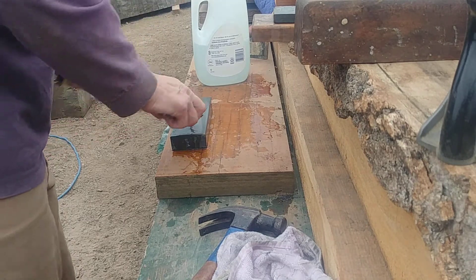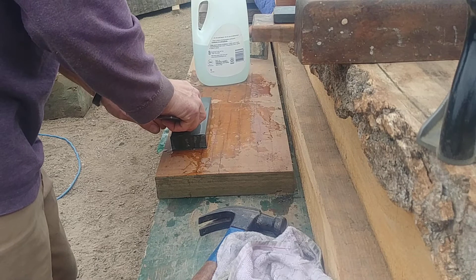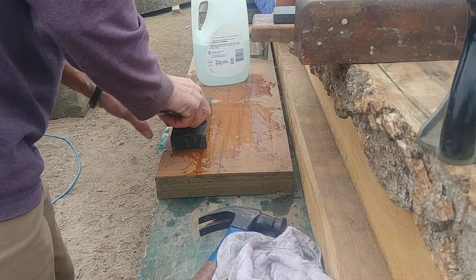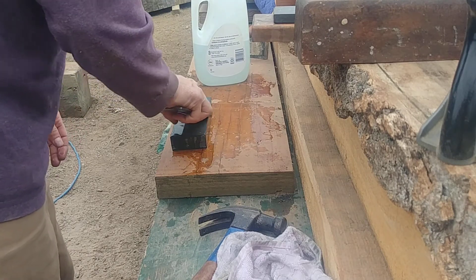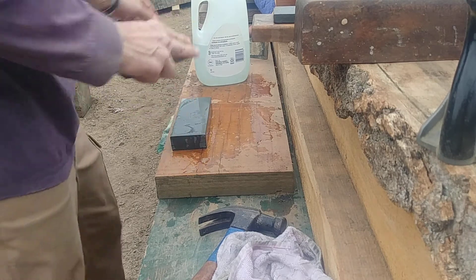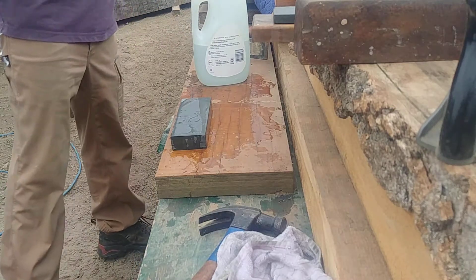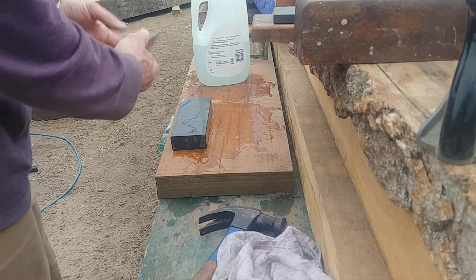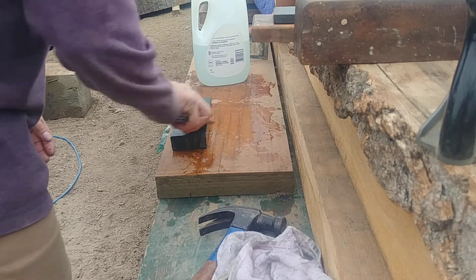The burr's back around in front. This stone, by the way, is a natural stone out of Japan — not really sure of the grit, advertised as 13,000. In the beginning it wouldn't cut much, but as I've used and conditioned it, it cuts wonderfully. It's the only other stone I need. I have a million stones and a million methods — part of my business is sharpening edge tools. A logger just dropped off reinforced gear I have to sharpen. But this stone: go from a diamond plate to this, nothing else is needed.